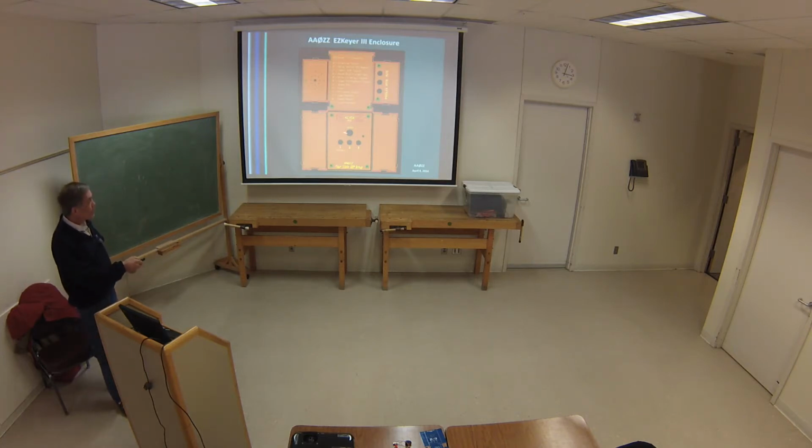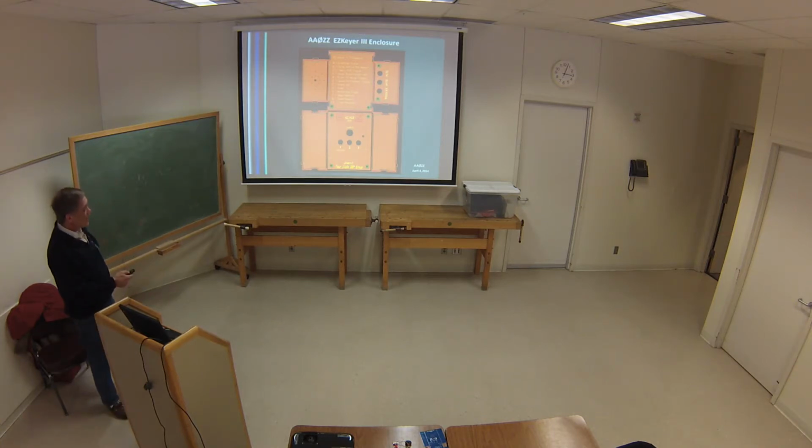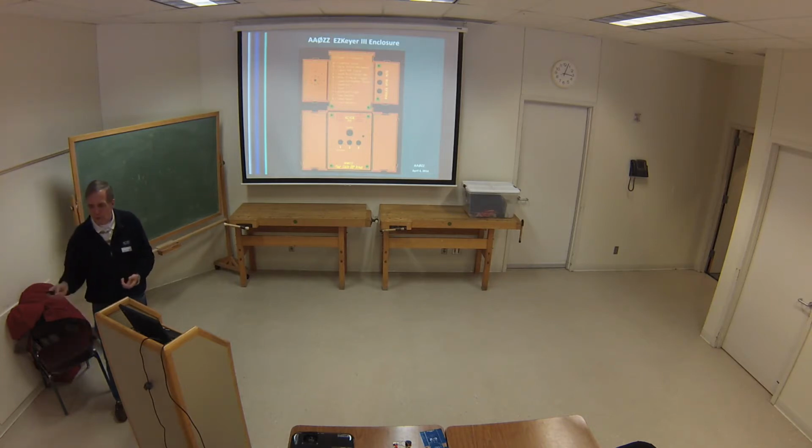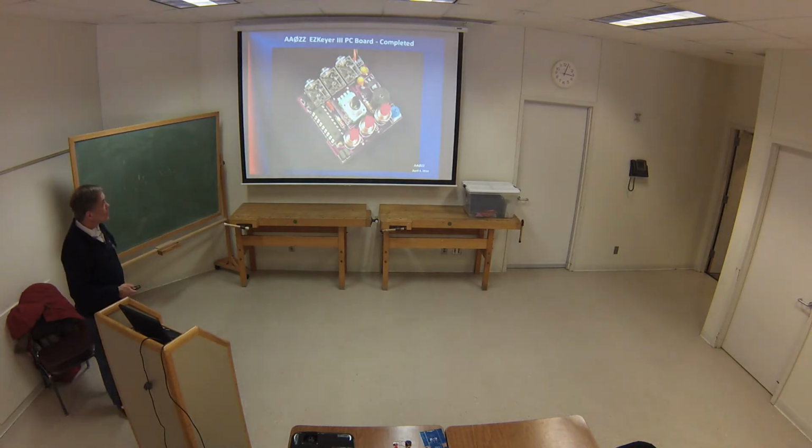So the speed pot is going to be right in the middle, and the 3 push buttons. The internal speaker is going to be behind that little hole, but otherwise it'll face you in the front. And the paddles and everything are out the back end, just like those before. And I added one key command in here, the P. P is going to toggle it back and forth between the speed pot, or if you want to use the paddles again, you can still do that. So there's the speed pot on it.